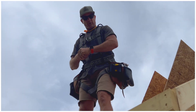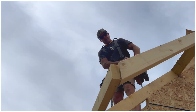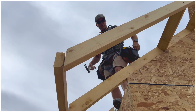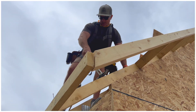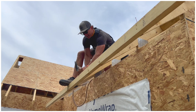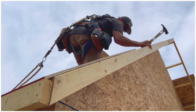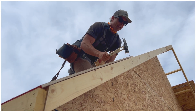About to start sheeting this plane. A few things done beforehand: we've straightened this gable, made sure our fascia is dead straight, and then we measure up from the top edge of the fascia board the width of our sheet and snap a line across the top. I'm going to set a couple helper nails at the bottom to hold my sheet. This is a 10/12 pitch so it gets tricky — I'll set a nail roughly where the bottom edge of the sheet will be on either side. Then I can rest the sheet there, dial it in on my lines, and tag it on layout. I tag it on my snapped line, lay out my trusses to keep them on correct layout, and because it's a steeper pitch I'll nail each row before starting the next course.